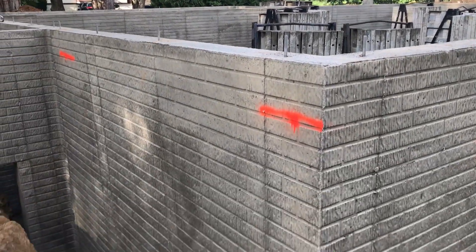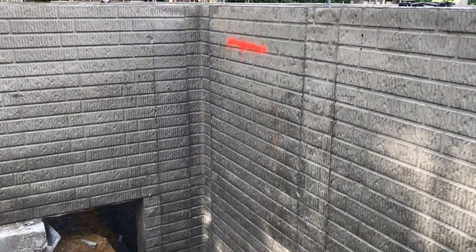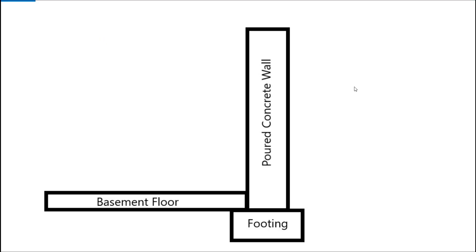Here's a quick look at what the foundation looks like after it's been poured. You can see the brick pattern and also the footing sticking out below the wall — that's supporting the wall. The brick pattern is because they use brick forms that have that pattern in them. Here's a cross-sectional view — if you cut the house in half, this is what it would look like. We start with the footing, which for our open book build was 16 inches wide and 8 inches deep. The footing is poured first, then the wall forms are set up on top and poured. We went with a 9-foot tall wall because we're going with a finished basement and wanted plenty of headroom. That wall was 8 inches thick and 9 feet tall. Later on, we come in and pour the basement floor, which rests on that little ledge left over — 4 or 5 inches of footing.